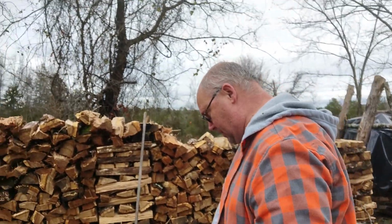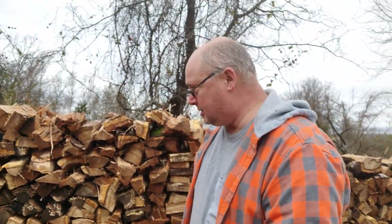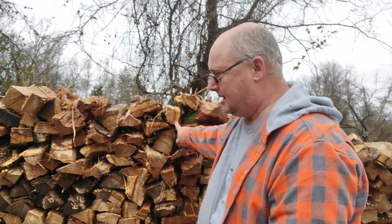Okay. I had a few other ideas, things I wanted to talk about that I didn't mention yesterday, or I might have gone on too long about. I talked about this wood getting wet. Well, we got about 2 inches of rain, and you can really see the difference now between how wet this is and how dry that is. Wet, dry. This wood won't soak up moisture. This will. But when this gets wet and stays wet, this can't dry out nearly as fast. So keeping it dry is a priority.